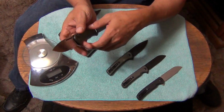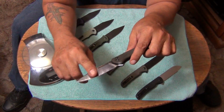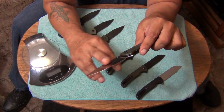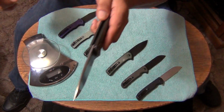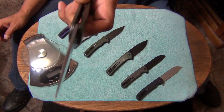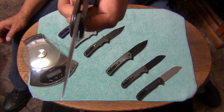Absolutely love it. Now, I didn't sand off metal really on this. I just took off the finish. That's all I was trying to do. I wasn't trying to change the shape of the blade or anything like that. I was just taking off the finish. And so I didn't use wet sandpaper that's made for removing material. I used wet sandpaper that was made for polishing.